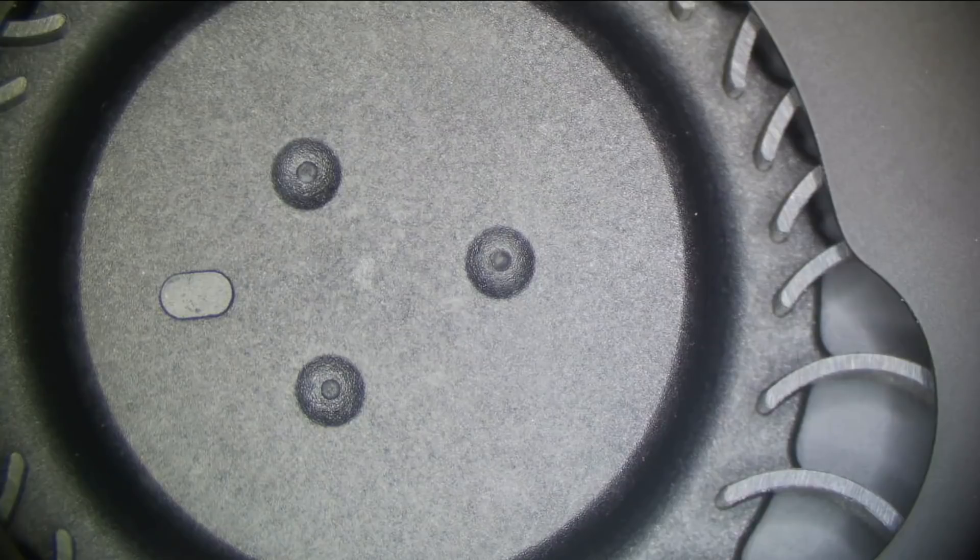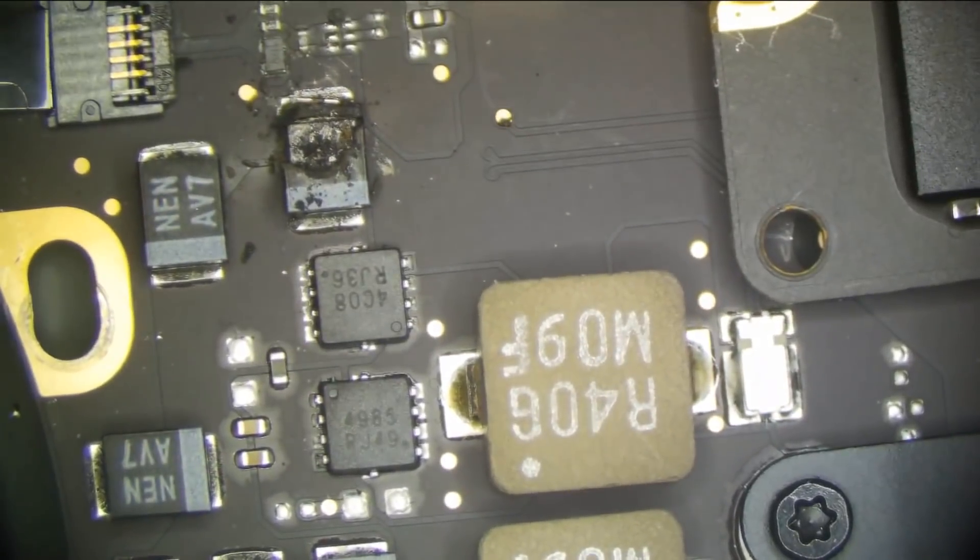What is most likely going on is that our ISL is dead. If that capacitor was shorted, our ISL may still try to put voltage into the line. The ISL cannot do that for long periods of time, and if it does that for too long, it's going to die from overload. So we're going to go ahead and replace this capacitor.